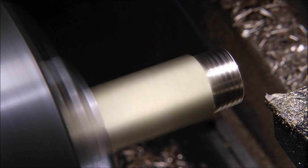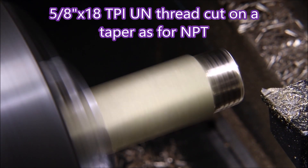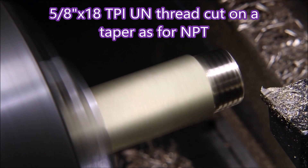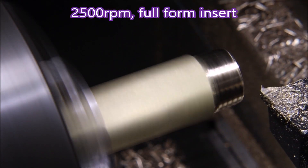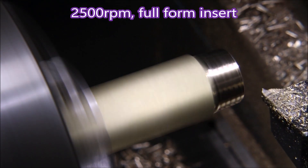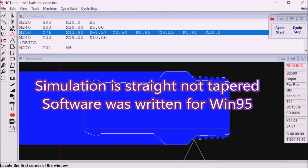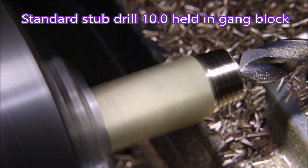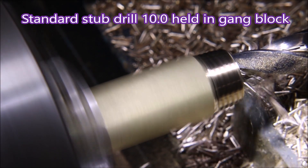This thread is a real oddity because it's tapered — it's 5/8 by 18 TPI UN thread form, cut with the same sort of taper as an NPT. I've made these before and had to make more of them. It's a little odd because although this machine will cut a tapered thread, it won't simulate one — when you simulate it, it just shows it as a straight thread.